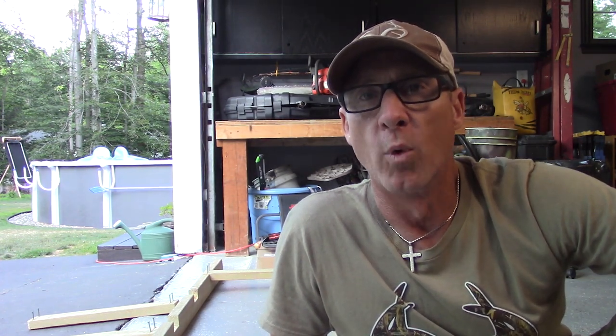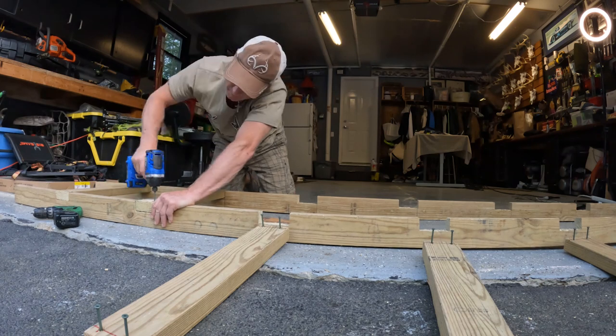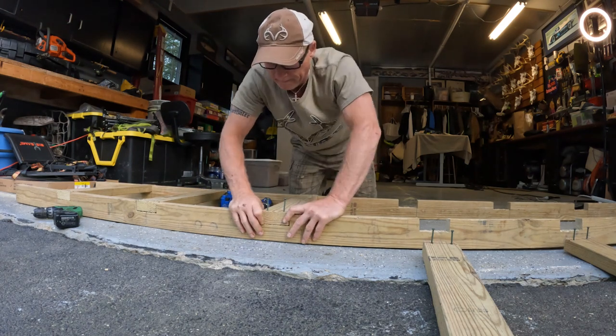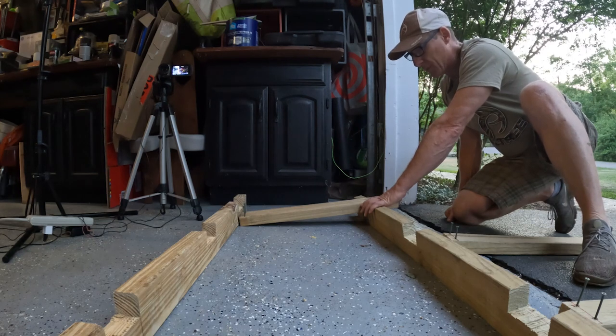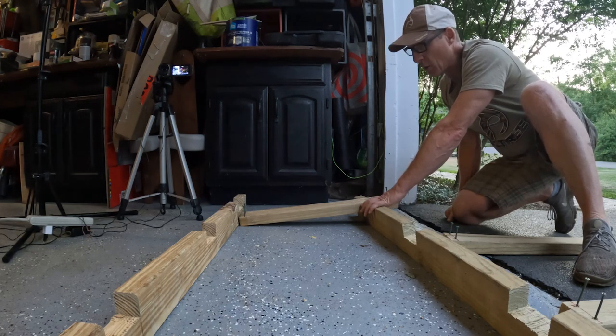Now I'm on the final step — I'm going to take all the rungs and screw them down into the ladder legs. As I said, there's a bit of warp to one board, so I'm going to start at the end that's not warped and move up towards the warped end, slowly getting these screwed in so it's the same width all the way across and I pull the warp out of the board. This bow in the board is a bit more than I thought, so I'm going to go ahead and screw in the top rung first and try to get that set before going back to the other rungs.